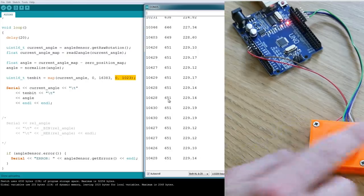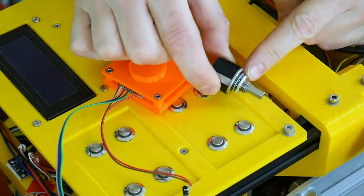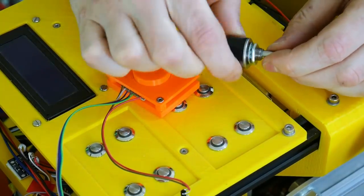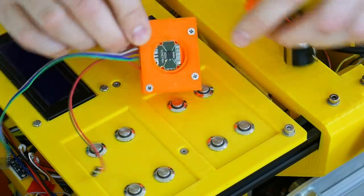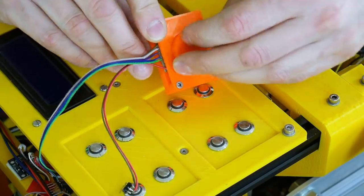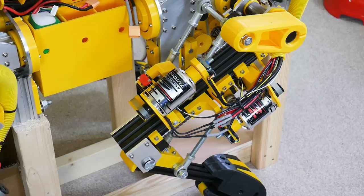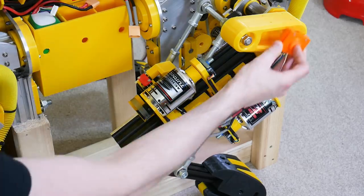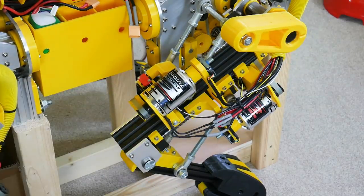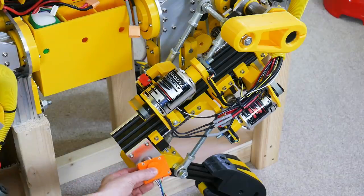That's actually a pretty useful device, and I really like how compact it is. Compared to a pot - which has a nut, a body you have to attach and turn - this is quite a lot simpler. Even in this overkill breakout package, the actual device is tiny. That'll be very much easier to integrate into the ends of joints and it's less bulky. It's much easier to accommodate something flat, perhaps even built into the aluminum at the knee or the shoulder, where we've got plenty of space to redesign, rather than having to stick a pot on the outside with another mount.